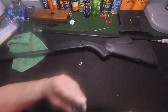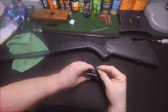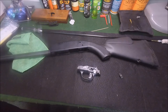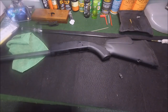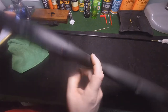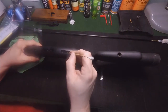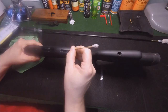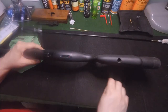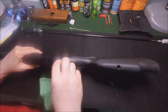Not sure why there's green paint on there, but it's coming off now. When you engage the safety it goes over top and will not let this thing lift up, and when you disengage the safety it moves back off and allows it to move freely. That's how the safety works — simple in design but effective. It just rides right up there in the slide. There's already a spring down in there we're going to replace, so we'll pick that out. We'll put that in the spare parts bin along with the rest of the safety parts. There's some oil and funk down in here — we're going to clean that out.